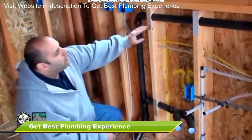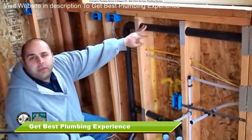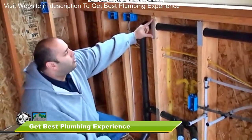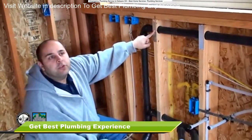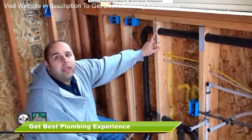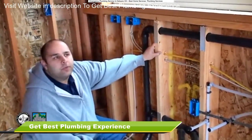As we follow our vent up, you'll notice it's nice and high on the wall, so that we can get above the flood level rim of the sink. If we have any backups, then it's not being backed up into the vent system. We've got our nail plate protection here, so that we can't put a nail or a screw through the pipe. It makes it more difficult for that to happen when they put the sheetrock up, or if you decide as a homeowner that you want to hang some pictures, we don't want to be able to go through that pipe. That's what that's for.